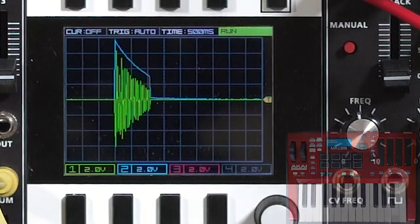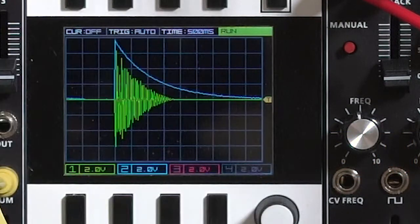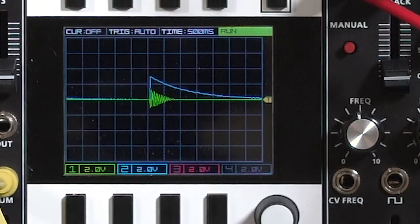You can see from the way the display is being drawn that the Roland 530 VCA does tail off to silence before the voltage coming out of the envelope has gone down to zero.